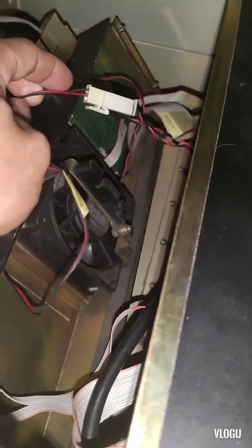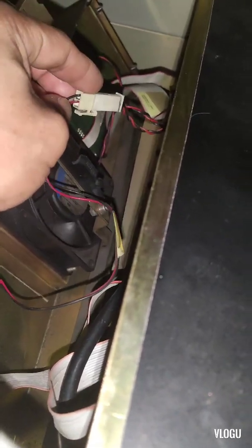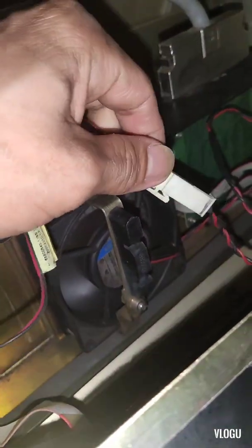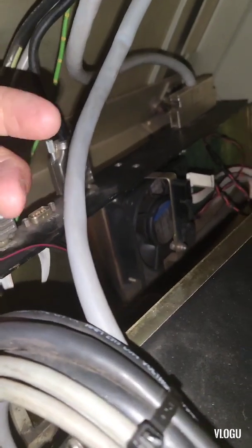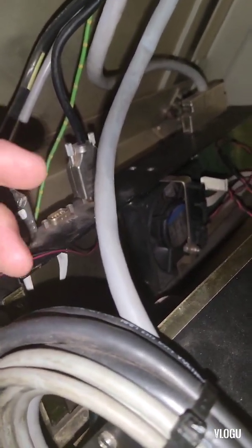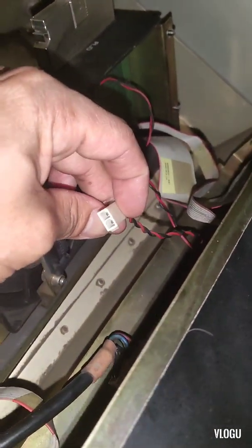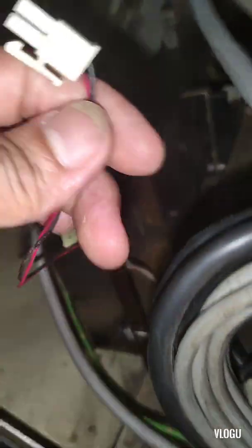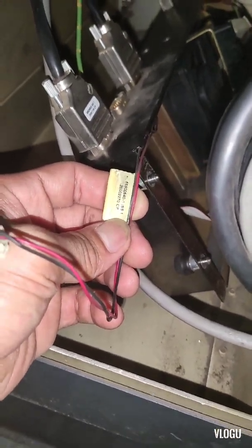Here, this connection — every time I moved it, the unit would switch on and off. So I think the problem is a loose connection on this connector, which is for the DC supply of the processor unit. You can see the wire is red and black — positive and negative — and that's the reason why the radar did not start up or power on.